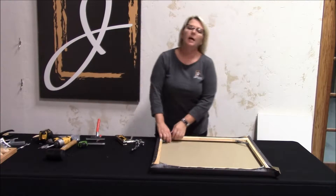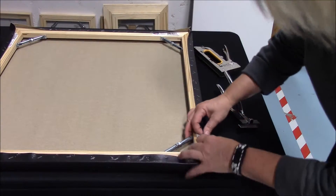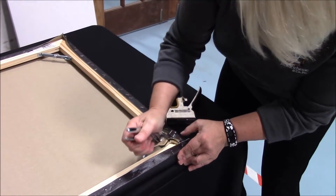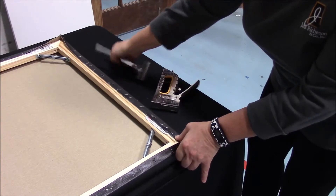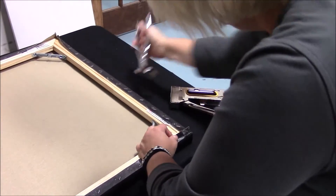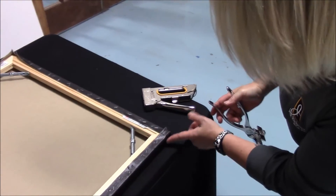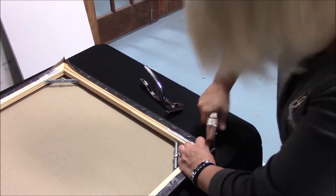I haven't really pulled yet, and then I'm going to use the best corner keys. So we've got the corner down. What we need to do is finish stapling into the corner. I'm going to continue to pull into the corner, getting the wrinkles out, and staple there. I'll use my pliers here to get it nice and tight so this edge and this edge is nice and smooth. Staple there, come back around, staple there, staple here — pull, nice and smooth. There's going to be a bump there, but you can pull that taut with your pliers, get it tucked under, and then staple that down.